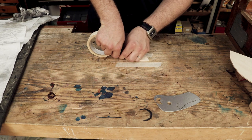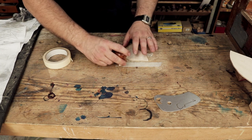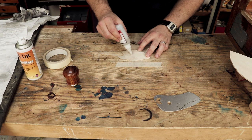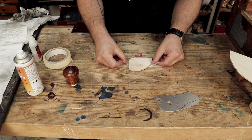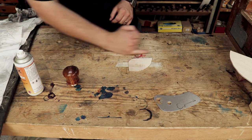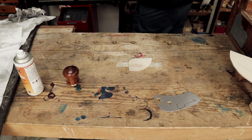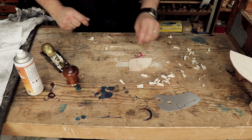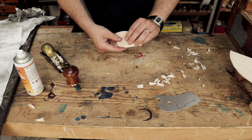If you've not seen the masking tape and super glue trick before, go and check the video — I've made a couple of videos specifically about this. Essentially it's a quick and easy way of holding a thin piece of material down that doesn't involve the abomination that is double-sided tape. It's got a lot of strength laterally but will pull up very quickly and easily.